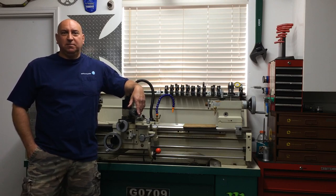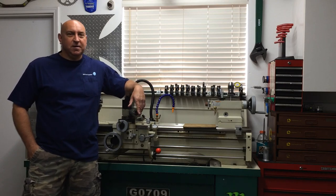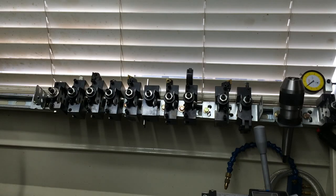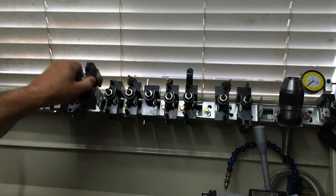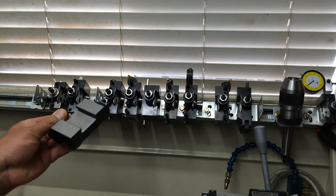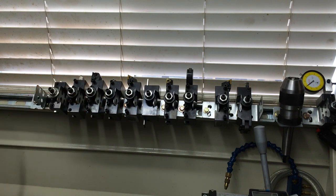I'm going to call this 'Mixed Mash One' - that sound good? Anyway, I'll start with the unistrut tool holder rack, Tom Lipton inspired. I tried to copy Tom's design but it would not work for me because I have a series 200 or BXA tool post on my lathe with series 200 tool bit holders, so it's a smaller dovetail.